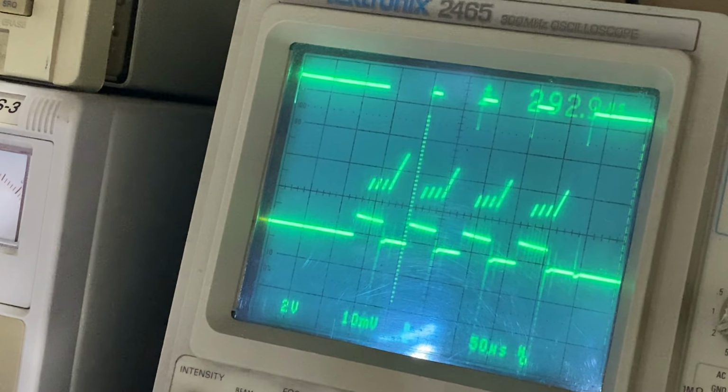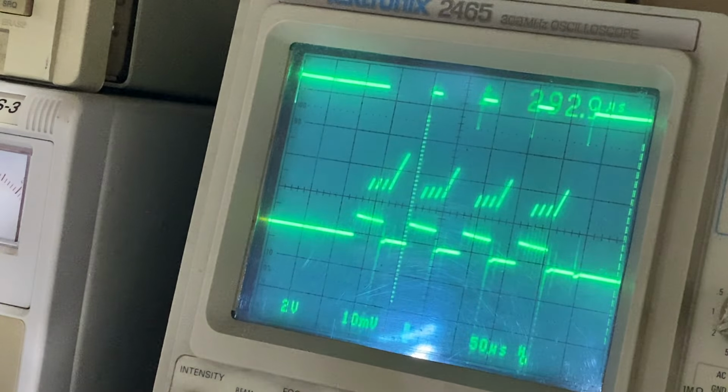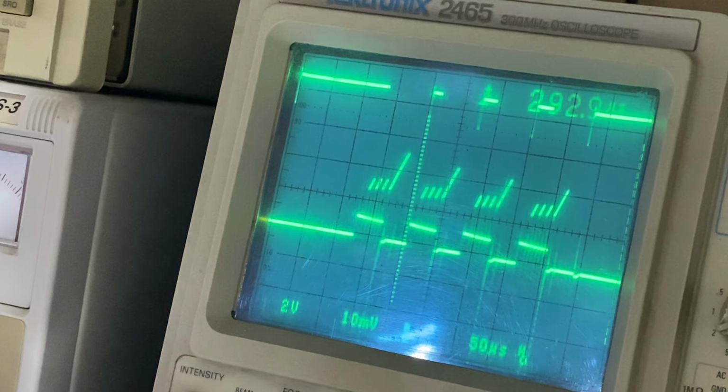Very, very simple. A bit of mathematics on the inductor and the frequency should tell me my resistor value and my capacitor value, just to take the edge off that. I can see it's got some spikes coming down from the top too, just at the top here. So we have a little bit of inductor leakage or something going on. Something's not exactly matched. Maybe 150 microhenries might be a little too much. Maybe we can get it down to 100 or 120 and clean it up.